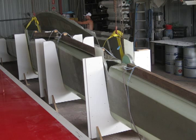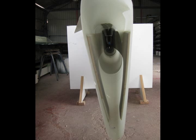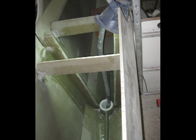The leeward hull is built the same way but from a single infused panel with only one joint down the middle of the deck. The panel weighs 130 kilograms, 286 pounds. It is folded to shape, the beam seats, bulkheads and mast bearings are installed and the decks are folded and joined. It has removable ends to allow for shipping in a 40 foot container.